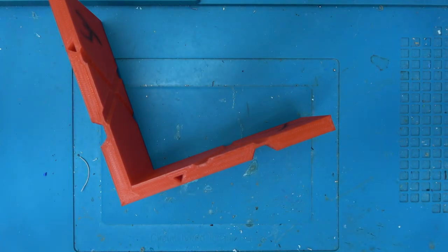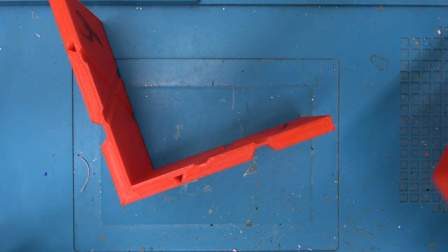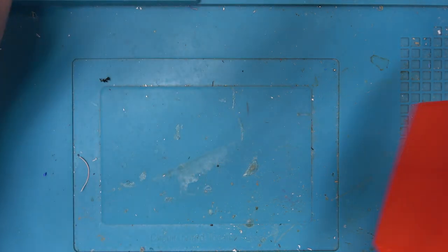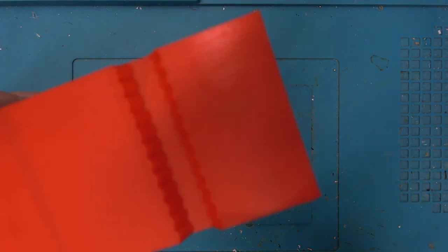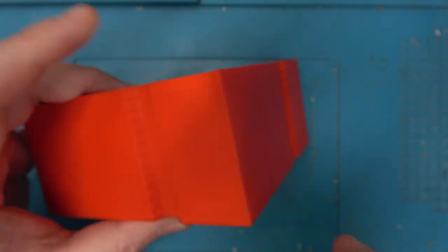So for the input shaping, the x-axis frequency was like 75 hertz, and then the y-axis was much lower. It was like 23 hertz, probably because it's much heavier. So this is after input shaping. Actually, let's see, where was...